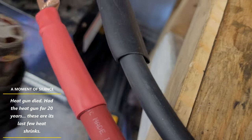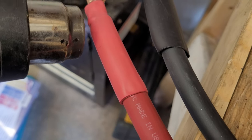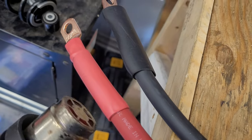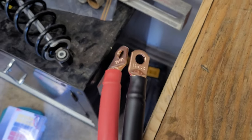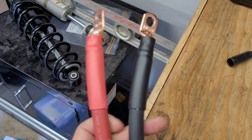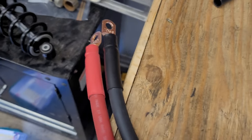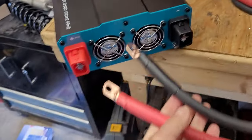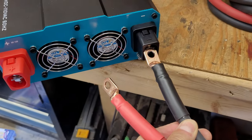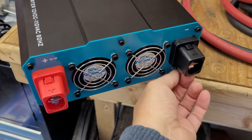It's always nice to heat shrink things after. These heat shrink casings have glue on them as well, so even if the crimp terminal gets loose, it'll still hold — it's just a great way to finish all your cables. I'd highly recommend doing it. And there we go — we've got two beautifully crimp-terminated 1-aught battery cable leads, all ready to be attached to the battery. This is the DC end of the 3000 watt sine wave inverter. You pop the cap open, put your negative terminal on negative, positive on positive, and that's it. There's also a grounding wire here.